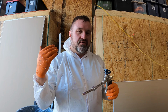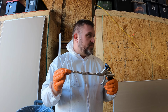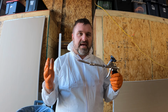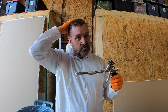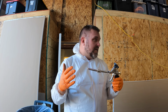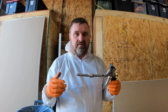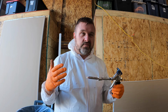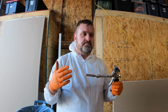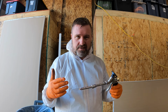The strategy to do a ceiling is different than a wall. And the Vega kit has all the tools that we needed to do this. So I'm happy with the kit. You get a really substantial discount on the second kit when you buy it on Amazon, from what I saw at the time of this recording. And 12 cans did about a 12 by 12 room worth of ceiling. And I got it to about 1 to 3 inches, let's just put it that way.